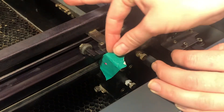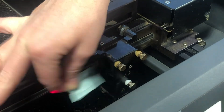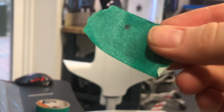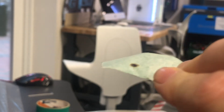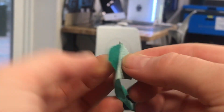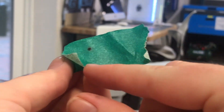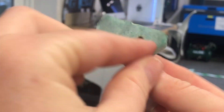Now we're going to remove the two pieces of tape together so that they come off in one piece. You should have two pieces of masking tape stuck directly on top of each other. Slowly unpeel these, because we're going to check to see if the two burn marks line up with each other. As you can see on this one, the two holes on either piece of tape are exactly in the same location, which means our laser cutter is aligned.